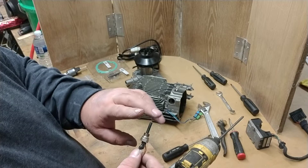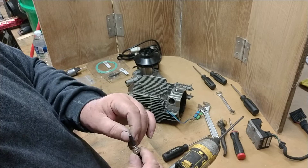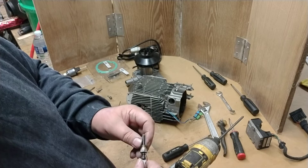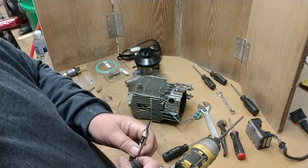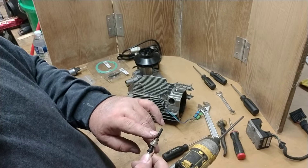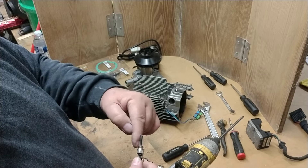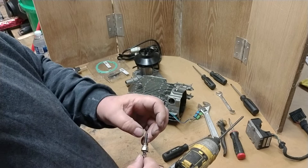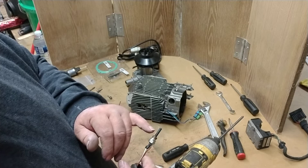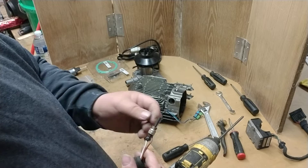What I find in service is these units will be run on low voltage. It's very important that the voltage be correct — most are designed to shut down at 11 volts, but even before that the unit starts to fail. The glow plug doesn't get hot enough to ignite the diesel fuel, but gets hot enough to create a hard crusty film buildup on it. People think that means the part is bad, but that's not always the case.